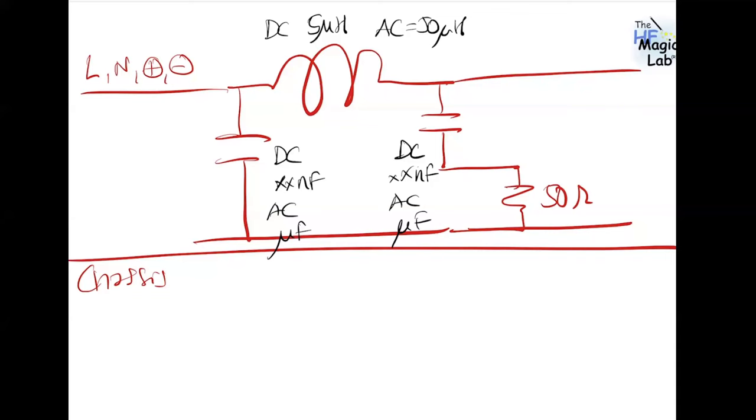Manufacturers solve this circuit in different ways, with very simple circuits like this one, or with several stages of different inductors and capacitors in parallel, but with the same idea, to offer a known impedance. Additionally, many of them introduce some kind of transient protector, so they are able to protect your system from transients while you are working, especially in power electronics or high inductive loads.